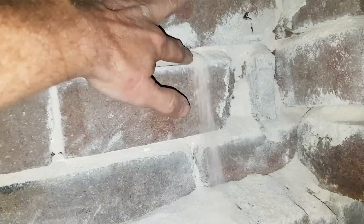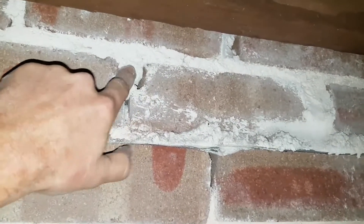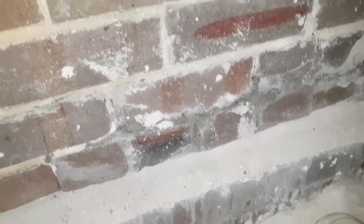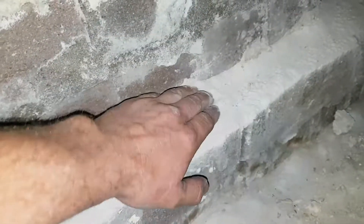You can see here that this building has been rectified a little bit — they would have had floors which were moving, and they've got new mortar up here and a damp course further up. But below that it's all drying out, pulling water up into the wall and turning all the mortar into dust, which will make the floors bouncy. Over time there'll be trouble inside the house with the floors moving, and all of this will have to be rectified.